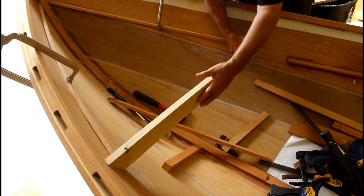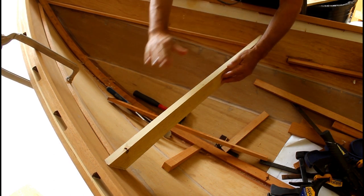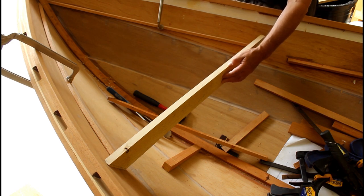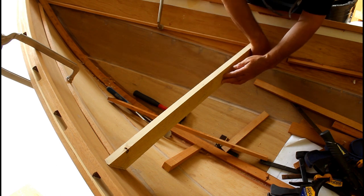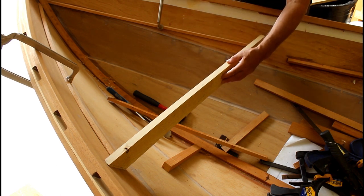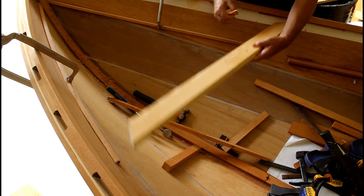And we've laid out a piece of white cedar here. The customer would like sort of a peak deck, so I need a large piece of lumber here. I've made and calculated all of the beveled angles. We've got a really nice fit on the front face here, the back face here. It's fitting exactly where I want, and now I have marked off its position on here.